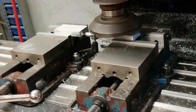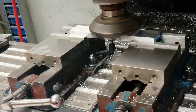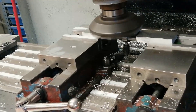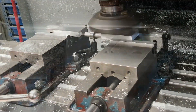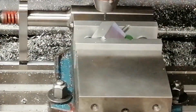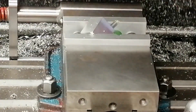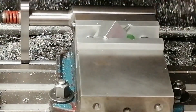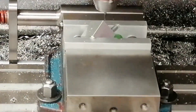Here's another example of tandem milling. It really boosts production by machining two parts almost simultaneously. Once you get your offset sorted, it's surprisingly simple. People sometimes say a three axis machine needs six setups to get all six sides — I like to see if I can do it in two. Sometimes it works, sometimes it doesn't, but it's a good challenge.